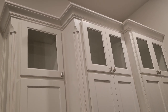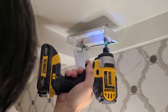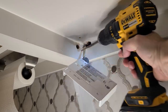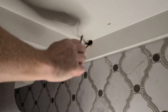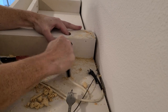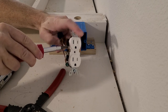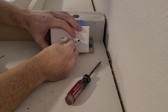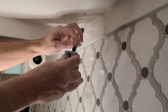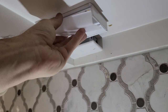For the third outlet, the idea is to tap into the wire that leads to the existing under-cabinet light and run that up through the gap between cabinets. I'm not an electrician — I don't know if running wire between cabinets is legit; I'm just showing you what I did. Running wire this way was actually a bigger chore than I thought — I used fish tape, rope, a helper, and a lot of patience. Using a spacer block, I'm mounting an external box directly to the cabinets. Back under the cabinet, I installed a junction box that connects the existing wire to the wire I just ran to the new outlet, and also to a wire leading to the reinstalled under-cabinet light.